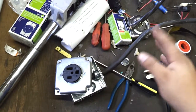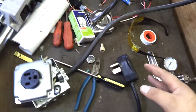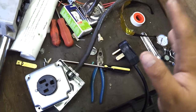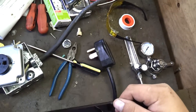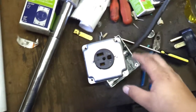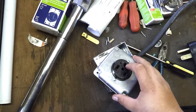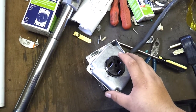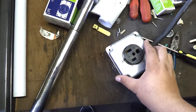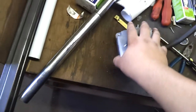I got 40 feet of it. After taxes it comes to about $2 a foot. Some people think that's really expensive, but try to buy a 10-gauge extension cord and find out what the price difference is — you'll quickly know this is the cheaper way to go, even with buying the box. The plug here is a NEMA 6-50 receptacle. There'll be an R at the end for receptacle and a P at the end for plug.